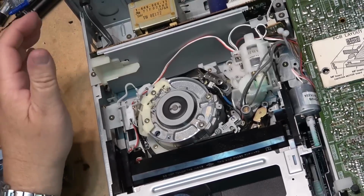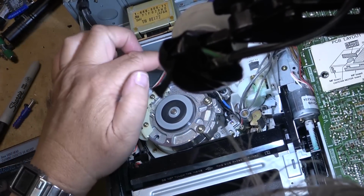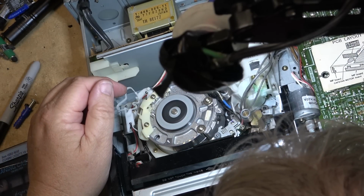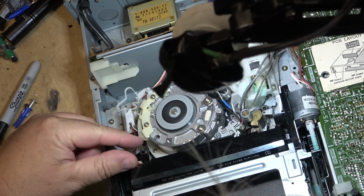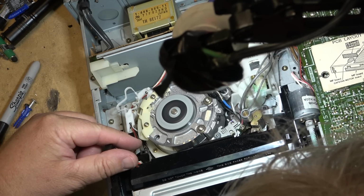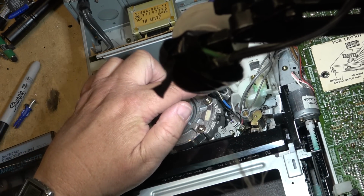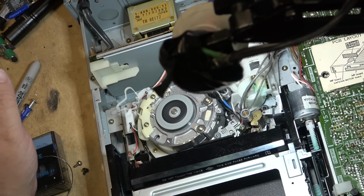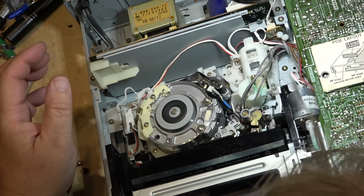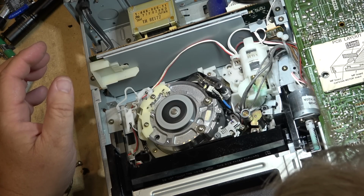This tape's actually in the process of failing. Watch the tape. You're going to see a bunch of tape go by here with oxide that's missing. You'll see, okay, here goes some oxide that's fallen off the tape. This tape is deteriorating. It's not wrinkled or anything, just the oxide that's fallen right off. You'll see it right here. See the oxide that's just fallen off the tape? That was a phenomenon where the binder is failing.